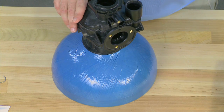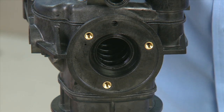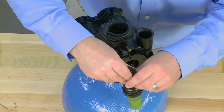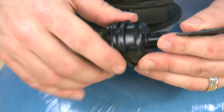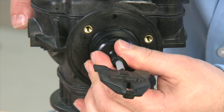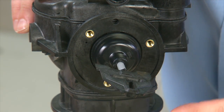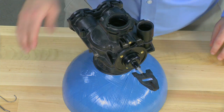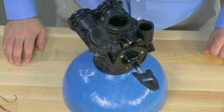When we install the last seal, make note that it should sit back from the front face by about 3/16ths of an inch. This allows room for our piston to seal up against the side of the body. When we install our piston, we add a small amount of lubricant to the o-ring seal on the cap, then press the piston in straight, making sure it seats. It is normal for this to sit proud of the front edge by about 1/16th of an inch — this will compress when the back plate is reinstalled. The remainder of the parts are reinstalled in reverse order of removal.